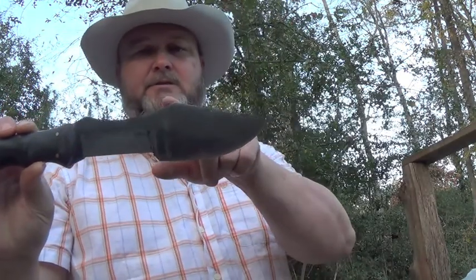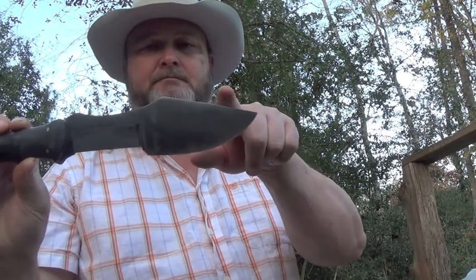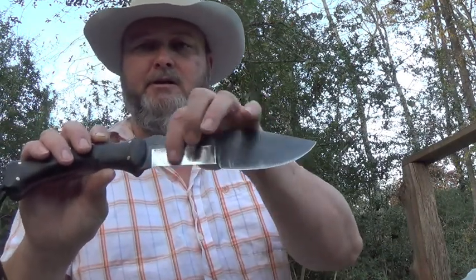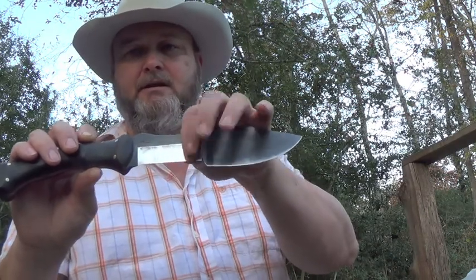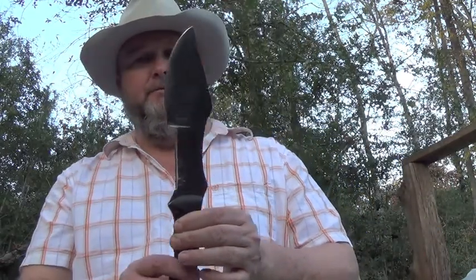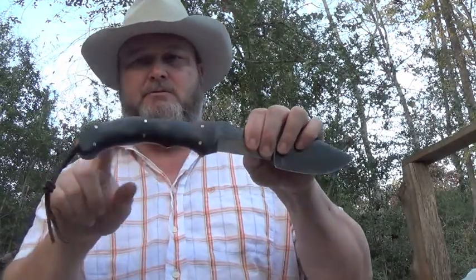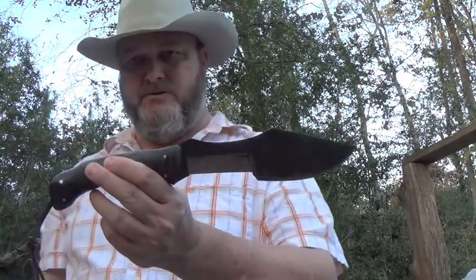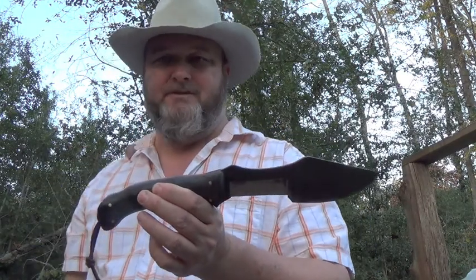It's different. David Beck's Tracker has a straight back — it's kind of a drop point. This is more of a clip point. The original had a hollow grind here, whereas this is just a flat grind. His current ones, I think, are a chisel grind, whereas this one is a chisel grind with a slight back bevel — I find that gives it a little more strength. His handle was straight where mine has a little more contour to it. So this is my take on the Tracker, or the WSK — the wilderness survival knife.